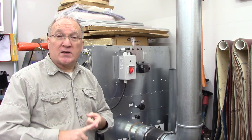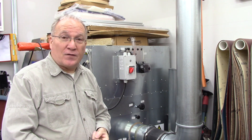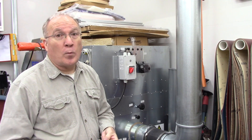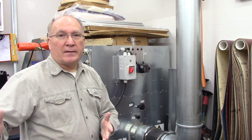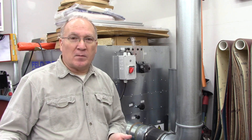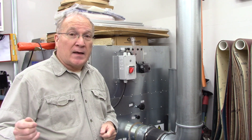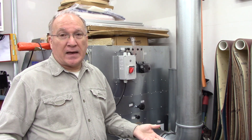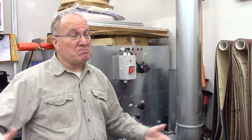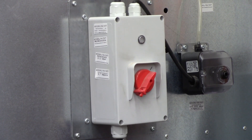Before I modified them, I could open one five-inch blast gate completely and the light would not come on. But if I had a reducer necking down to a four-inch hose ten feet long, the light would come on and I'd have to partially open another gate to stop it. I want to ensure enough flow through my dust collector. I'm going to test with a five-inch blast gate fully open, then open a second or third if needed. I'll also test with a six-inch gate - previously with a six-inch gate open the light never came on.